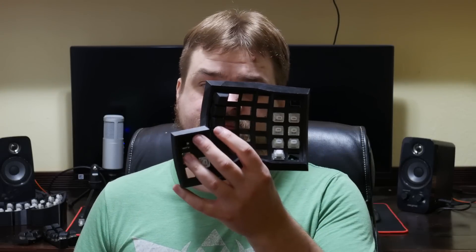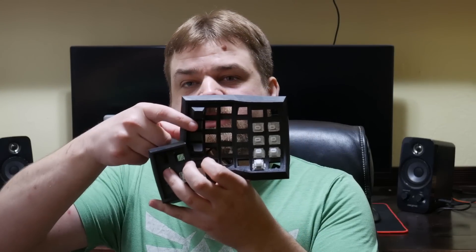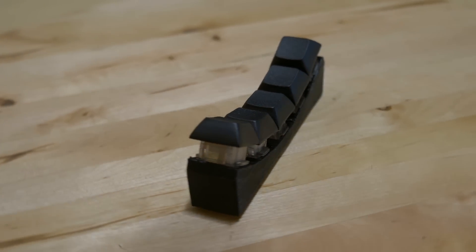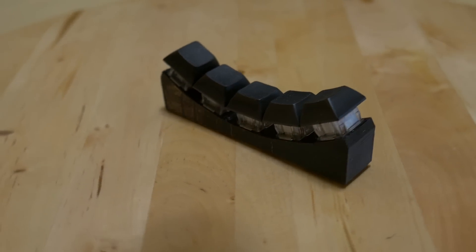The top part with all the keys had wrong spacing as well, but I didn't realize that in this version. I waited until I printed off even another piece and noticed that whenever I pressed the keys they would actually get stuck on each other. That whole print and the previous print were useless. I should have done prototyping for key spacing at the very beginning, but I wasn't thinking about it — I was only thinking about the cutout hole for the switches themselves. So then I printed off two little pieces for testing out the spacing on all the keys.